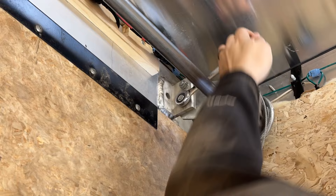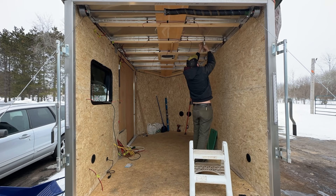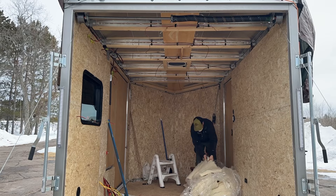Back to the ceiling. Just like the walls, the ceiling is going to be insulated with sheep's wool. If you're wondering why I'm using sheep's wool instead of something else, check out my previous episode — I go into great detail about why I love it, especially for a metal frame structure like this. To hold the sheep's wool in place I'm simply stapling up some string. An alternative method would be screwing into the sides of the furring strips and wrapping the string around the screws.